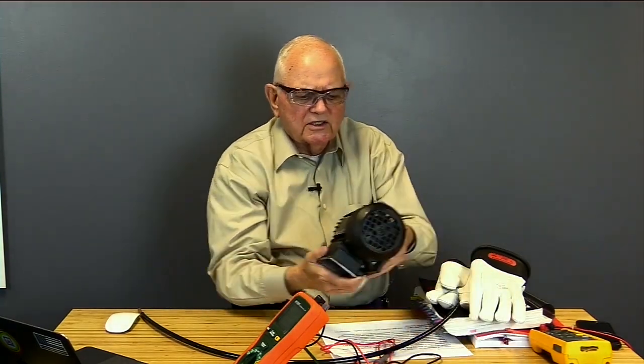And actually in a motor, if you've ever looked inside of a motor, you can see the copper windings underneath that clear varnish usually, can't you? So it's a pretty thin insulation, and it's pretty hard if you try and scratch it or something. It's pretty tough insulation. So what happens to that insulation on those windings? Over time, it heats up when the motor runs, it cools down. It heats up, it cools down. And over time, that insulation begins to deteriorate.